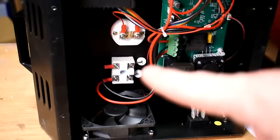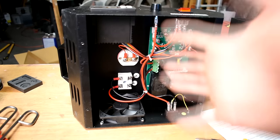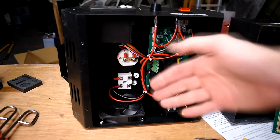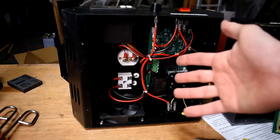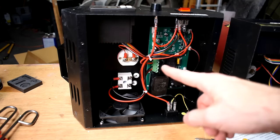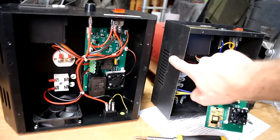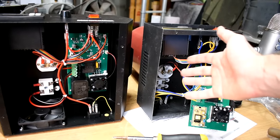So this one reads almost 12 ohms — it's a less powerful furnace. But the elements are exposed, so it could be more effective. That hole in the top is covered over, so it might be able to give you the same amount of heat in the crucible with less energy going in. I'm definitely going to try to melt some bronze with it right away. Some people have had trouble getting it to melt bronze, but mine does it just fine.